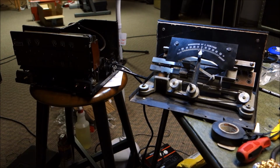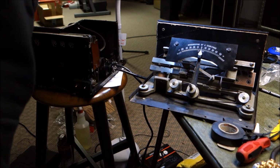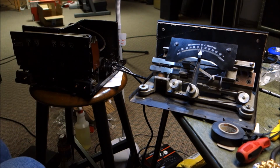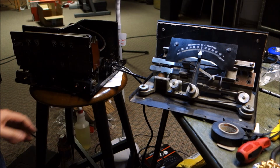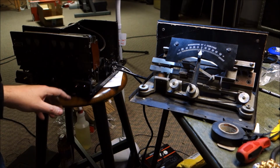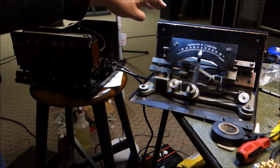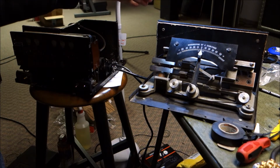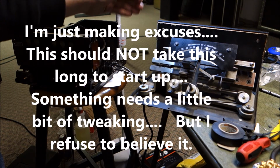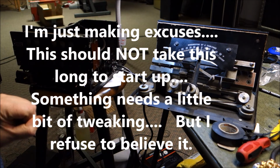Okay, kids. After we did our surgery, we're working. The only thing I wish I could do anything about, which I don't really think that I can, is the warm-up time. When we flip this into warm up or motor warm up run, the circuit over here has to take the time to warm the tubes up and begin to produce enough signal to start driving the tuning fork.